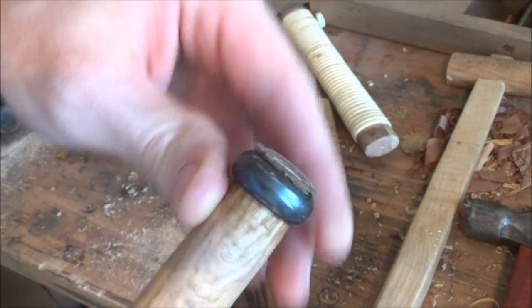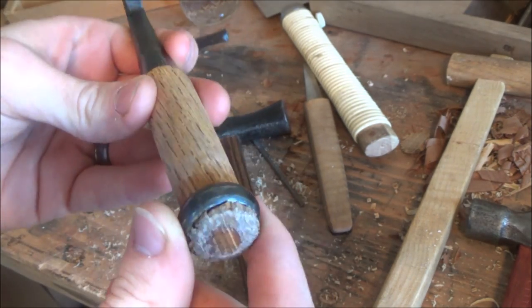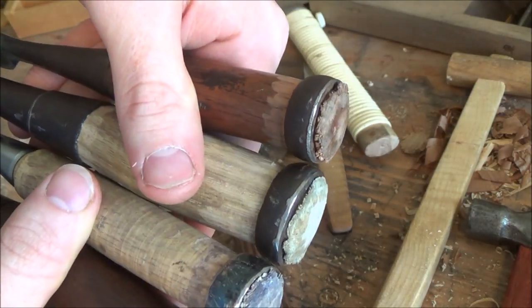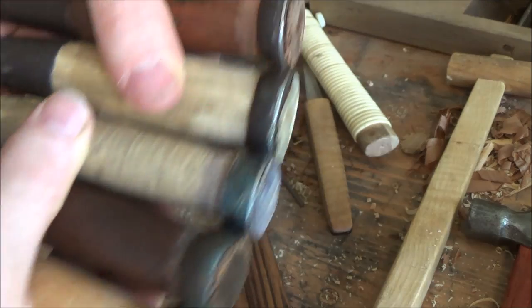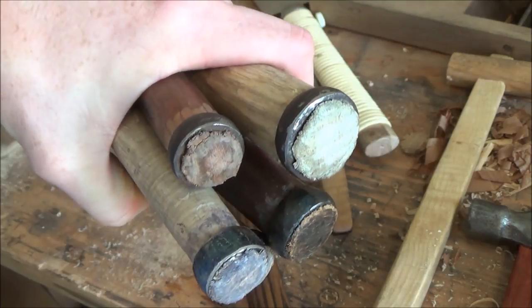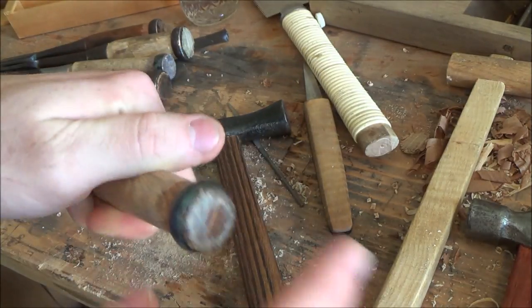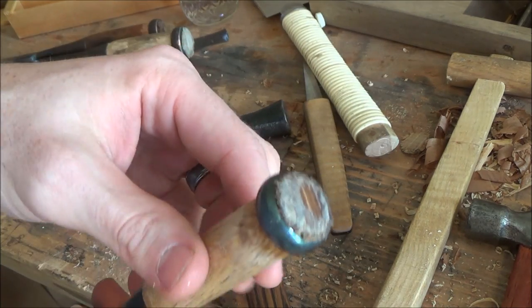You want that to be rock solid. That is essentially the method that you use to set up your Japanese chisel hoop. It's really not that complicated, it doesn't take a lot of time, it really doesn't even take a lot of work. To give you an idea of what some of my other chisels look like, you can kind of see the consistency — this is all the Japanese chisels that I've got. Each one should look fairly the same depending on your work style and what you prefer. There is no perfect way to set up any tool. It's all about what works for you. As you work and as you strike the back of this, it'll continue to mushroom over, and it'll just work better and better as you get better using it.